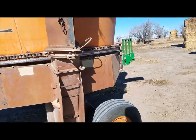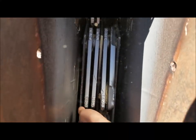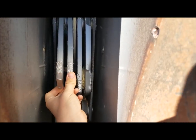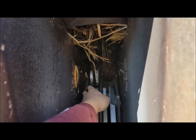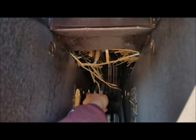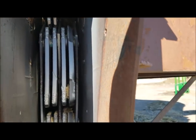The grinder itself is just a giant hammer mill. These are your hammers — they are reversible and these ones are starting to get some wear on them. You can see what the new side looks like; they work really well. To replace them you rotate up to the hole here, pull the pin. You've got to pull the snap ring off — that's not the fun part.